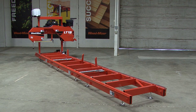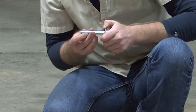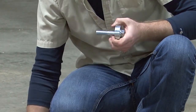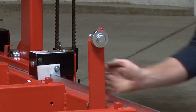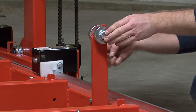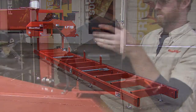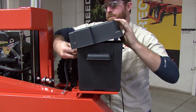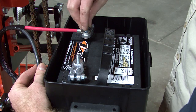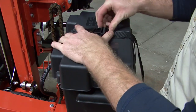With the sawmill nearly complete, we can add the included rollers to the bed side supports. These rollers should go onto the three side supports nearest the log clamps. First, insert the bronze bushings inside the six provided rollers. Then take the provided bolt and slide on a washer, followed by the roller and bushing, then another washer. Insert the bolt with roller into the hole pre-drilled into the side support. On the opposite side of the support, slide on a washer, roller and bushing, then another washer. Secure all of these into place using the provided nylock nut. Repeat these steps for the remaining two side supports. Now hook up the battery cables to the appropriate battery post — the red terminal should be connected to the positive post and the black connected to the negative post. Once connected, reinstall the battery cover and secure with the strap provided.